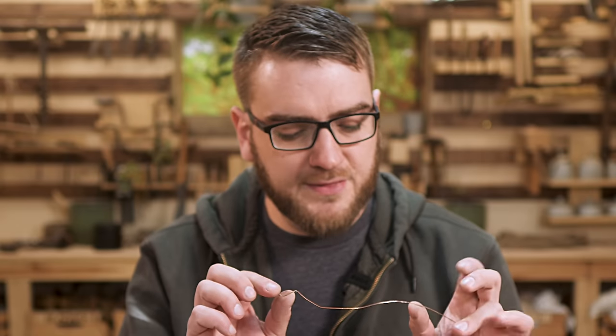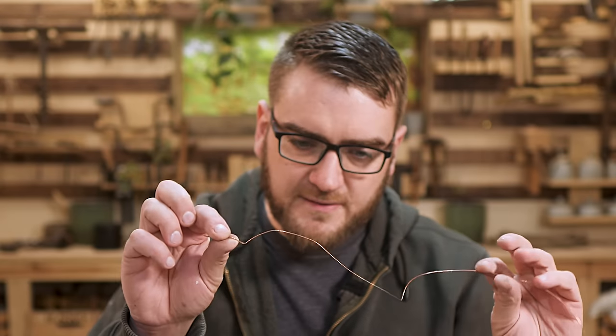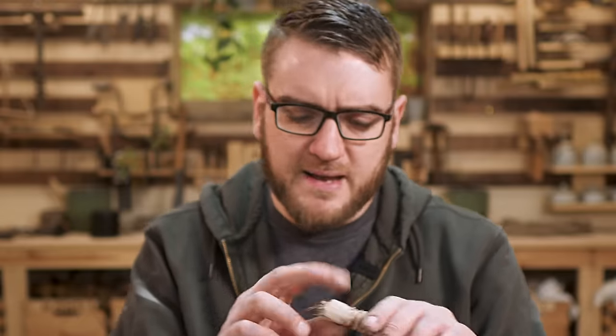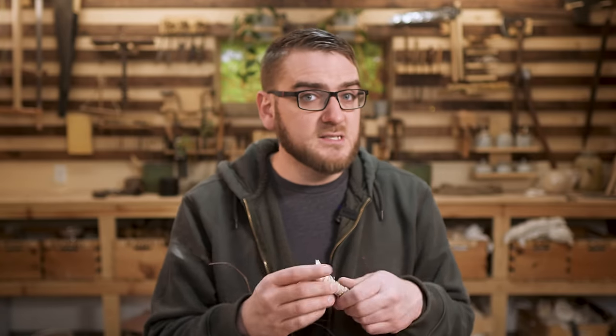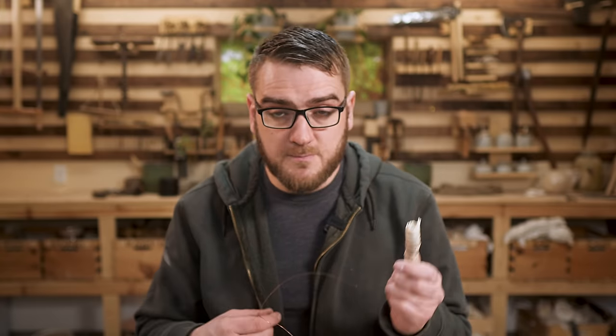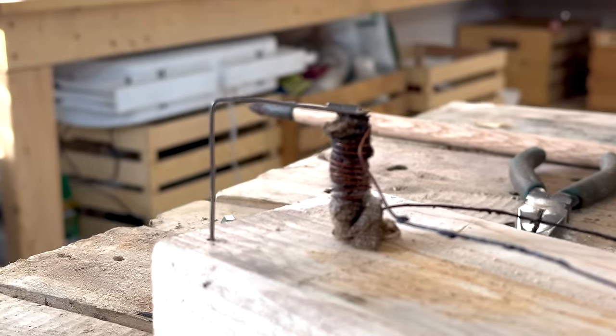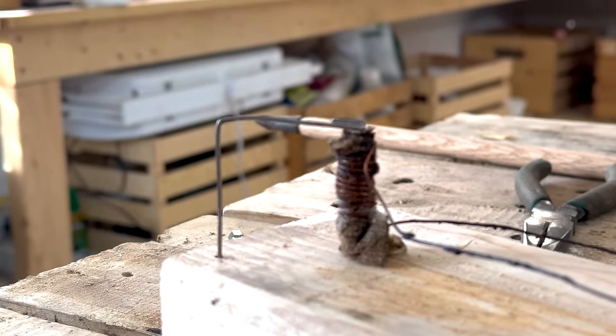The concept of wire is probably not the most interesting or fascinating, but this little device really opens the door, especially when you use it to make things like the electromagnet. A little bit of refining — mostly by getting some actual insulation on our wire so we can wind it a lot more tightly, and getting a stronger battery — and we can actually build some pretty powerful electromagnets. It's a pretty crucial invention for things like motors, generators, and the telegraph. We're actually going to try and make our own telegraph system pretty soon and basically invent our own very first telecommunication network.